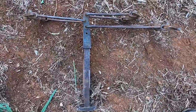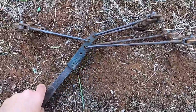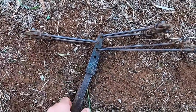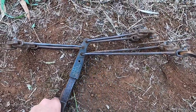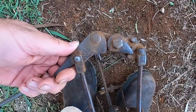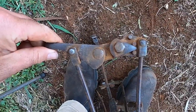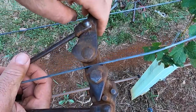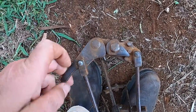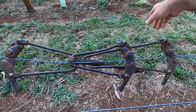The Donald strainers were spectacularly simple — a central lever that adjusts two claws on one side and one anchor claw on the other to walk the jaws up the wire. The jaws themselves were very cleverly designed with a trigger mechanism and a point of balance that locks it open. Slide the wire in and snap the trigger shut — you don't ever have to put your fingers near where the jaws and the wires connect.